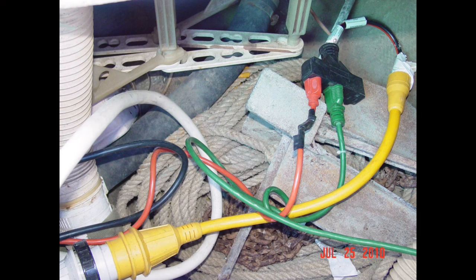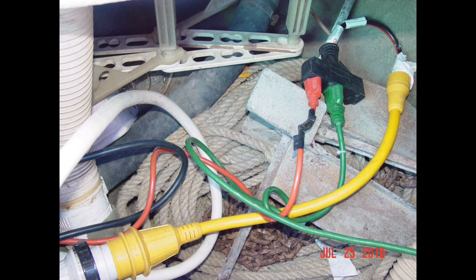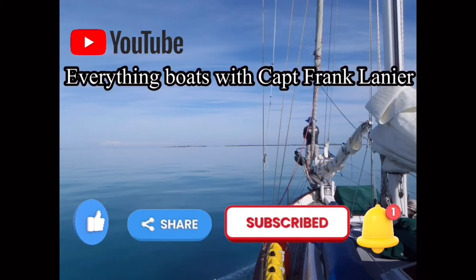The owner of this vessel needed AC power on board, but he didn't want to fuss with any of those frilly add-ons like plugs, breaker panels, and permanent wiring. His solution was to simply take a 30-to-15-amp adapter, cut the end from a three-plug extension cord, then tape the wires to the prongs at the 15-amp adapter end — no need for that fancy electrical-grade tape either. While quick and easy, this approach pretty much defies any standard or recommendation regarding AC shore power installations known to man. This type of MacGyverism, when you're talking about AC shore power, can result in anything from shock hazards, fire, death — pretty much all the bad things an improperly installed AC power system can bring to the table.